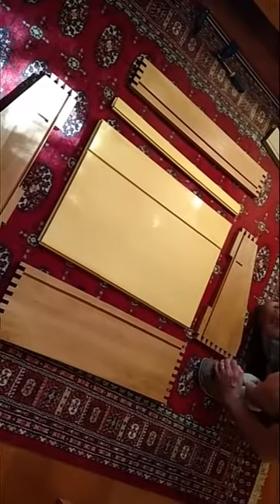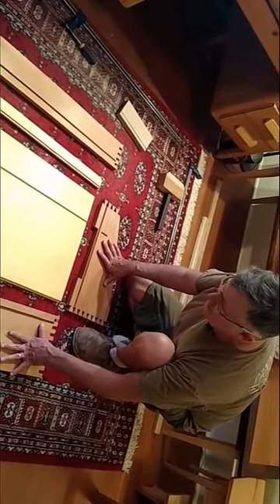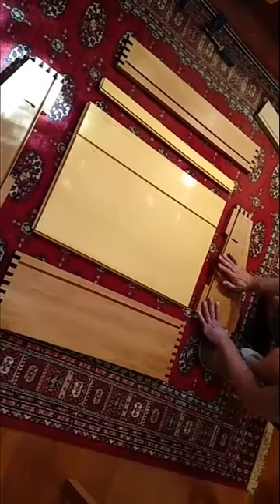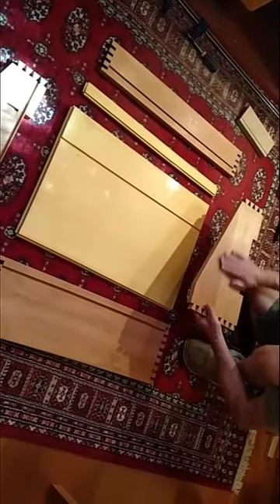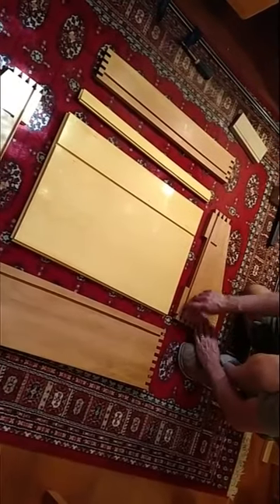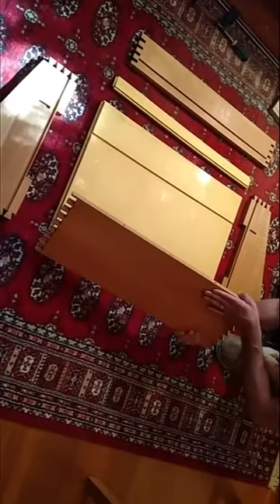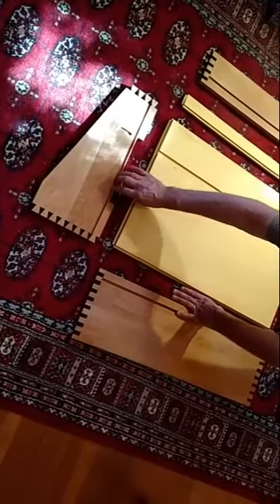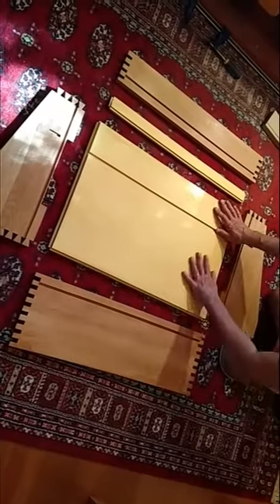Here are the six pieces that form the box on the top part of the desk — probably the most exciting part of the assembly process; it's like putting together a little jigsaw puzzle. To begin, it's important to orient the pieces and visualize how they'll come together. Starting with the left side — this is the front, you're facing this way, this is on your left. It's important to have the face sides down, and the grooves or dados on the inside facing the middle. On the back, this is the tall piece — face side down, groove in the middle. Same with the right piece: face down, groove in the middle. Then the shorter forward piece: face down, groove in the middle.